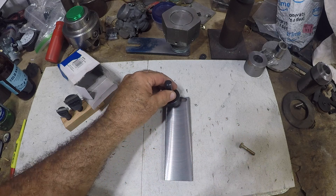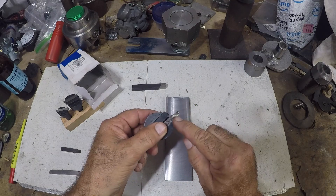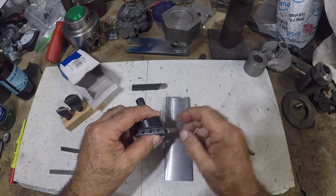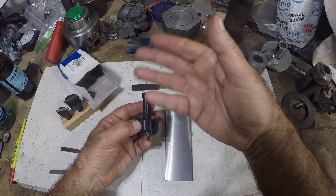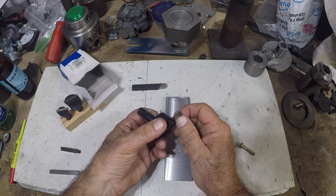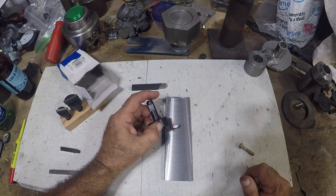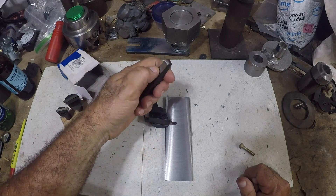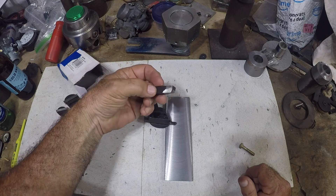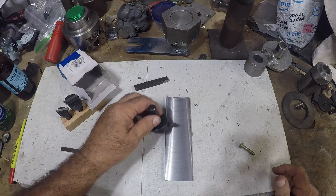I think that was a success. Hopefully you guys got something out of that. Don't get caught up too much in the angle — I was just kind of guesstimating. You know, it says nine degrees, but one thing I read is you have to have a nice big radius, and that's what I did and it turned out well. I'll sharpen this up with a stone and keep it nice and sharp like you should with any of your high speed tools.